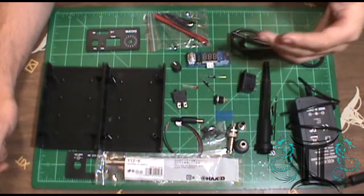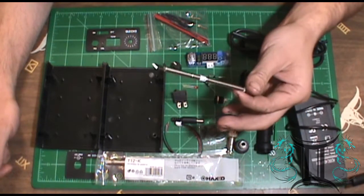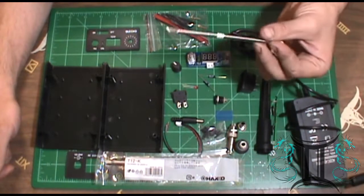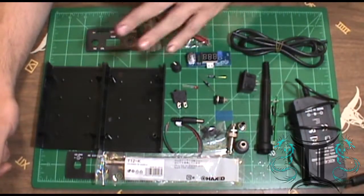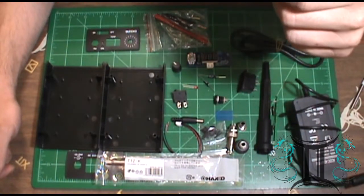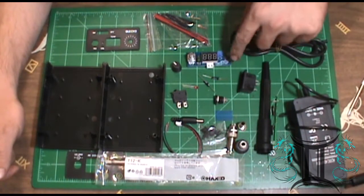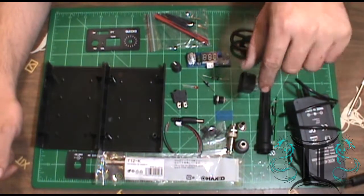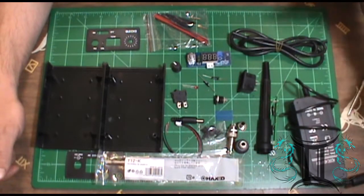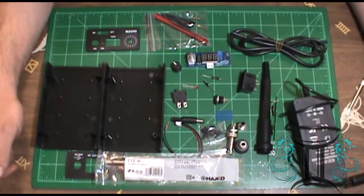I wanted something cheap, and I wanted something good. I like these style soldering tips, but I don't want to pay the $300 price for the soldering station that uses them. So this has got to be a trial run. One, if I can get this thing set up to use a Hakko soldering iron handle. Two, if I can get this component here, this W200D, soldered on the back of this instead of going through the actual handle. Three, a replacement for my station. And four, it's a cheap DIY project anyone can do.